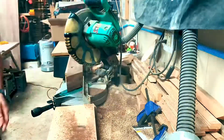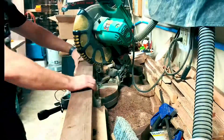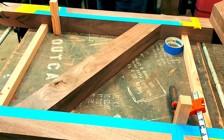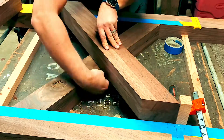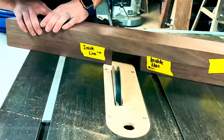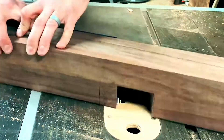Once I had all the pieces milled up, it was time to start cutting pieces for the legs. I do have a stop block — it's out of frame — so each piece got cut to the same length. Then it was time to figure out where the half lap joints are going to intersect. I attached the top and bottom pieces to my workbench, glued blocks where they needed to meet, put the pieces in there and marked them, then set up my dado stack in the table saw to remove that material faster. If you don't have a dado stack, you can do this with a single blade — it just takes a little bit longer.